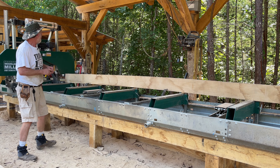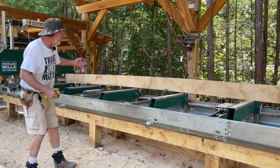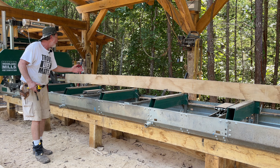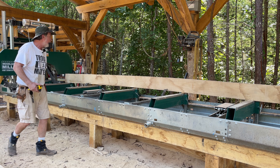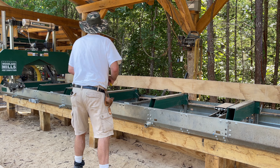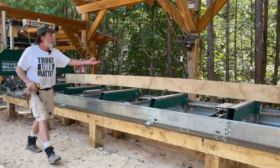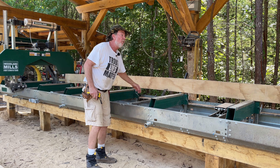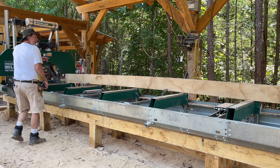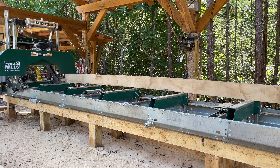We've got a board here — it was cut at a one by eight, it's like seven and three quarters. I've got a bow in it from where it's at. So we're going to actually cut it out and cut it straight. I can't promise it's not going to warp again, but it should be stable because this is dry. Now you can cut it straight and use the board. When I've got them bowed up like that, I'm looking at my bottom end — what's the smallest cut I can make where I'm going to get through this? I told Jay we've got to be up at like seven and a quarter inches to make this board work, so we still get a premium board.